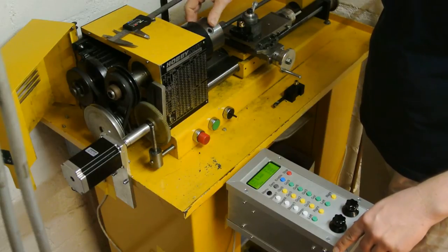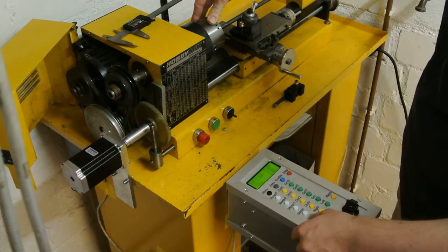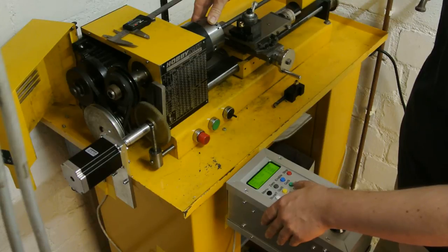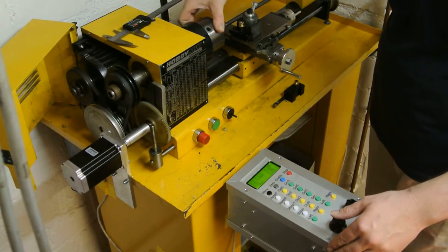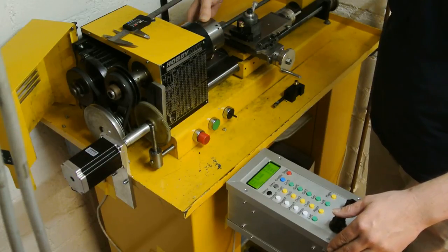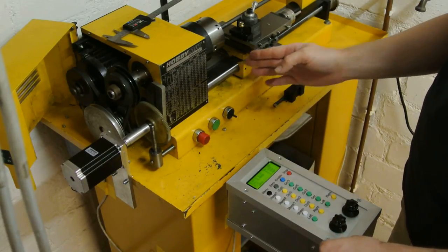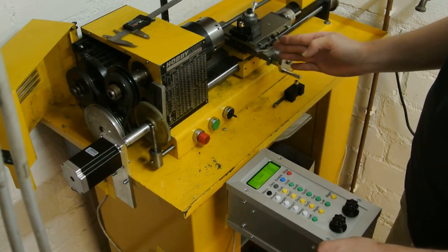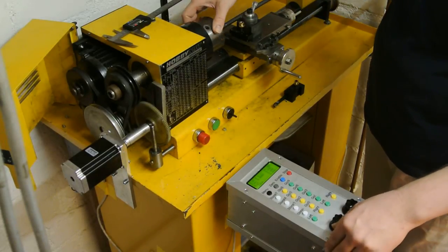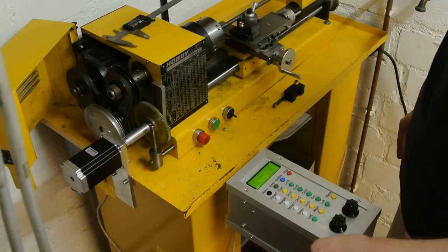Now we don't hear anything. We go a little bit to the left at low speed, then automatically go to the right again to zero. And now here we see noise again. So the position by the stepper was exact, but what you see, we did not 100% use the same noise. It was due to the inexactness of the lead screw.